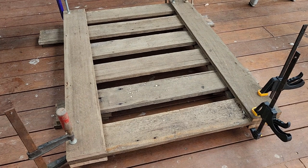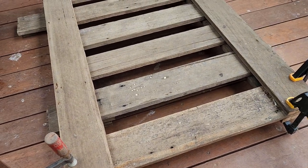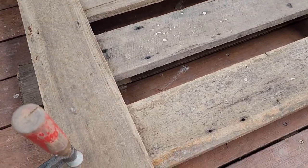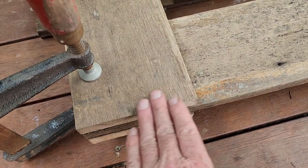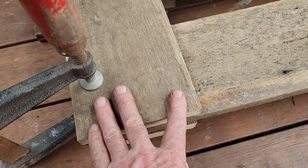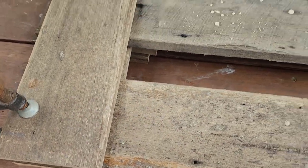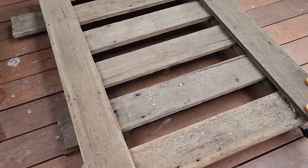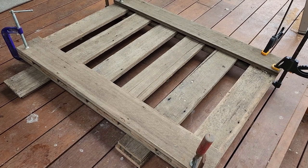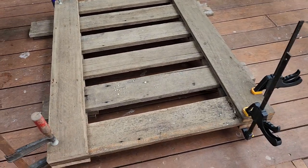With our new shorter gate design, I'm still going to put two bolts per board down the side rails. Even though there's a lot less chance of the gate sagging now that it's relatively narrow - about 900mm - it is still a very heavy gate. Some boards are a little bit cupped so I'm thinking two bolts approximately a third of the way in, which will keep the side rails nice and flat. The center boards won't be able to cup because they'll be sandwiched between the uprights. It's going to look over-engineered, but most things I build are over-engineered. Once I've squared it all up and clamped it, I can start drilling holes and putting bolts through.